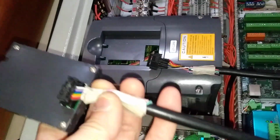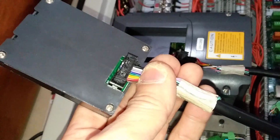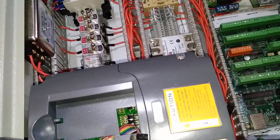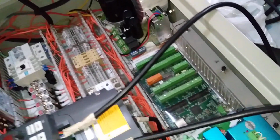Now I put on a long lead wire. This cord has 10 lead wires, and I made the connector here and plug in here. You can see it's not very good because my rainbow wire is thicker than the original one, and the connector plastic broke. Anyway, on the end of this long cord, I put on a plug here and a socket here, so I can connect it. The cord is about 2 to 3 meters in length, and I will remotely control the VFD.